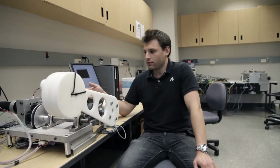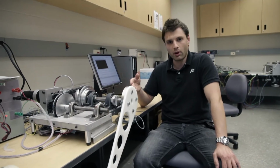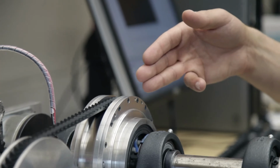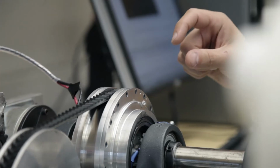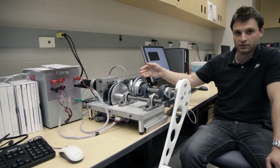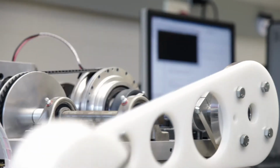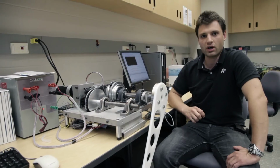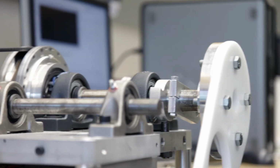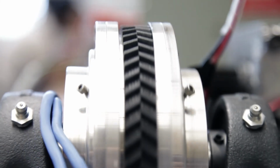This is an example of our actuation approach, which uses a single magnetorheological clutch to drive a robotic arm. The transmission torque is controlled by varying the magnetic field inside the clutch. Tiny sensors embedded inside the design of the clutch allow us to measure the intensity of the magnetic field. By using feedback from these sensors, we're able to achieve closed-loop torque control without the use of costly torque sensors. Torque control is essential in human-safe applications as well as numerous other robotic and industrial applications.